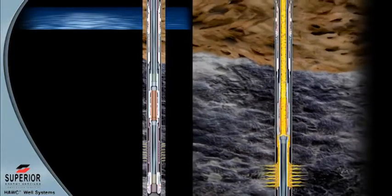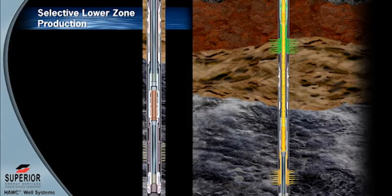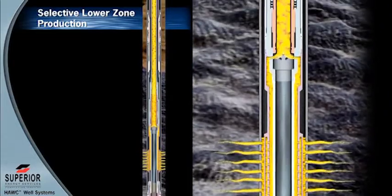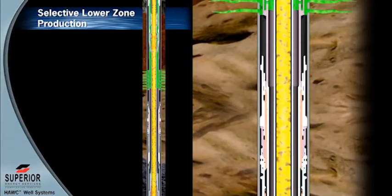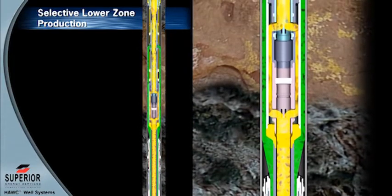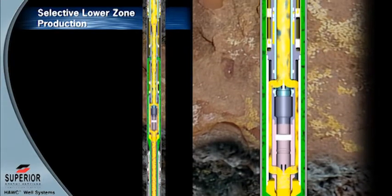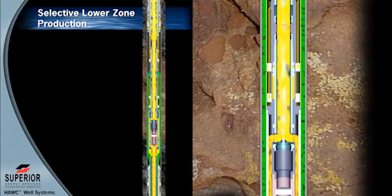Both the annular and radial flow valves have dual lock-open features and redundant mechanical shifting systems. The well is placed on production by releasing the pressure in the production tubing. The predetermined under-balanced condition not only assists in valve shifting but also ensures the hydrostatic on the formation is less than formation pressure. The production flow path begins by flowing through the lower production screen, around the lower isolation tubing, through the radial flow valve, through the internal production isolation string, and into the pressure containing shroud surrounding the lower hydraulic multi-service valve. Fluid is prevented from flowing directly up through the production tubing by a plug placed in a nipple just below the lower hydraulic multi-service valve, and flow continues up through the shroud and into the lower hydraulic multi-service valve.